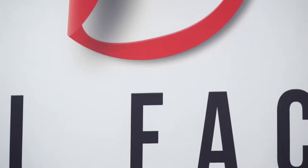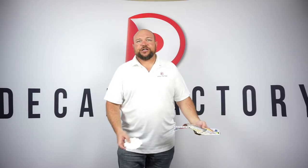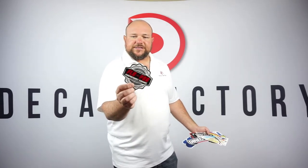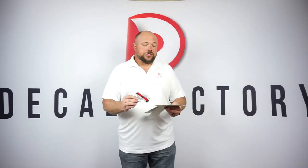The thing that has blown everything away is digital. Digital has made it so that four color process or full color or CMYK is accessible to anybody for any quantity. It's changed the print industry completely. You still need a very good machine to get good results, but you don't have to run thousands in order to get the price down. This here would have been a spot color decal — you can see those black lines around the edge. There's no way silkscreen could have done this. This has to be done digital. And they're lasting outside now.